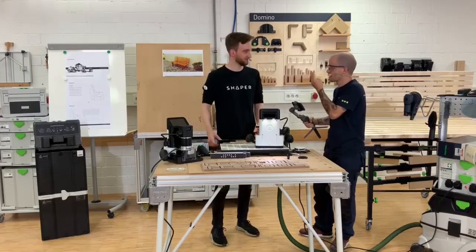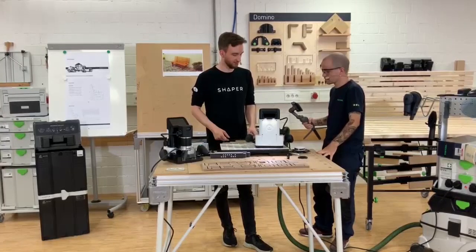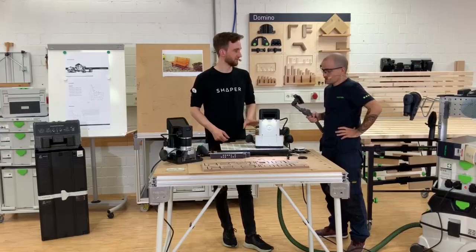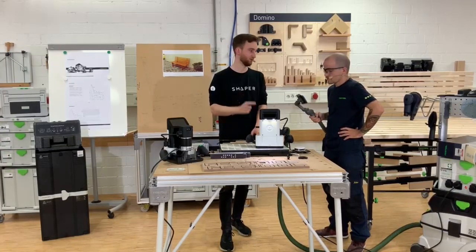I usually thought I would do like three passes. Three passes. Not like five. Easy. So you would do the first two with a little offset. Yep. And then on the last pass, you go on contour, and therefore you get a very nice finish, the so-called finish pass. So it's two roughing passes and then one finish pass.